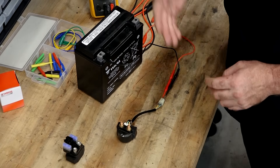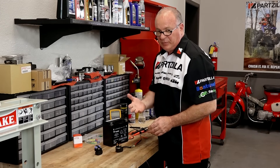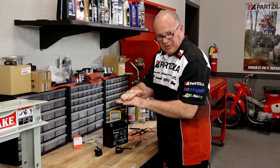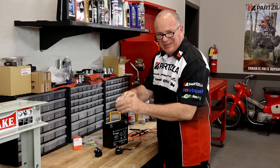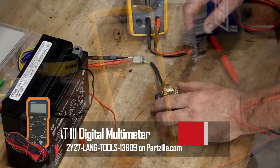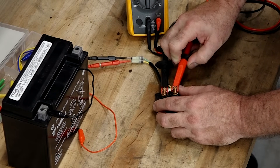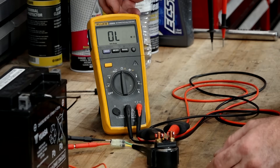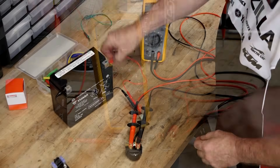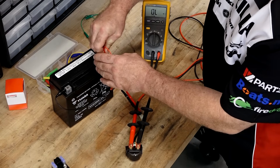But from previous experience, sometimes you'll hear that click but your machine still won't start. And the reason being, the contactors come together, but there may be corrosion or they may have gotten burned. At any rate, they're actually not passing electricity through it. So what we need to check for next is just using a regular volt-ohm meter, and we're going to take a resistance measurement across these two points. And when it's at rest, it's going to read OL, which is basically an open circuit. Now when we energize it, it should connect these two points together, and we should see something around 0.2, 0.3, maybe even as high as 0.4 ohms.